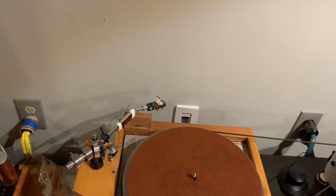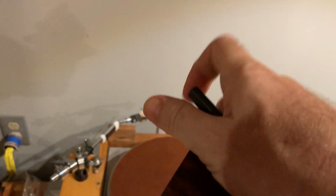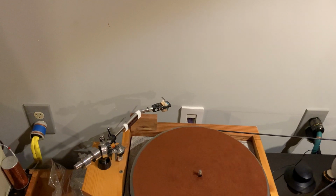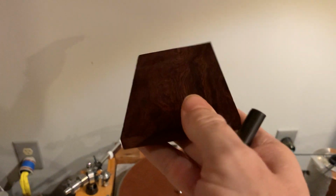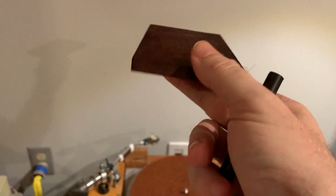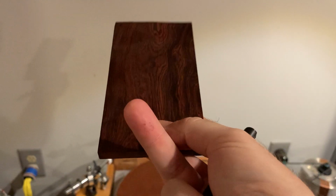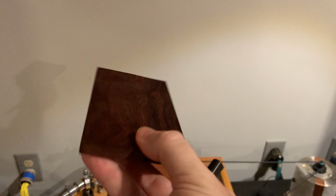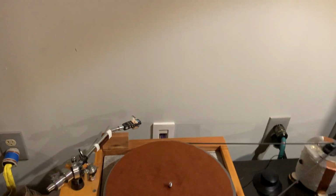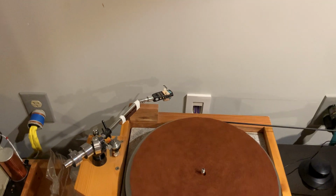Because it's a really nasty way to treat a head shell, because if you add weight higher up, then it's like that anti-keel situation. Where I showed you that if you have your boat or your tone arm and you have the counterweight, which is the keel weight down, then it stabilizes it. If you add weight above the level of it, above the plane, then you destabilize it. And I really wanted to fix that for a long while, and finally I was forced to do it.